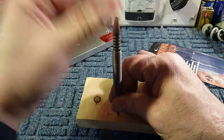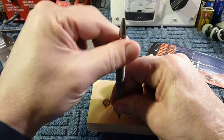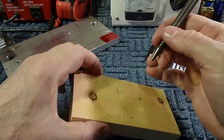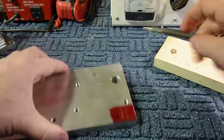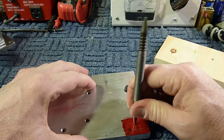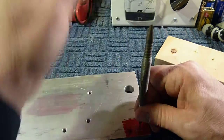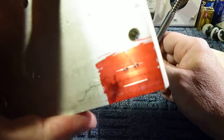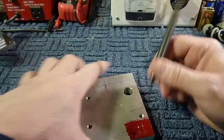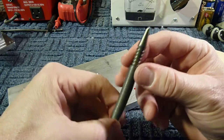I'll do the next one — two shots and that one I sent slightly under, and the third one I'll put even further under. You can see it does a really nice job. I'm shocked at how well it works. Here's some aluminum — let's say you scribed some lines on your Dykem. Once you get that area lined up, you can easily locate the lines and pull it in. In aluminum it does a nice job, and you can always double or triple up if you want a deeper mark.